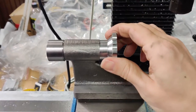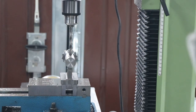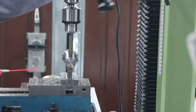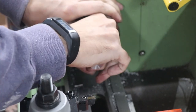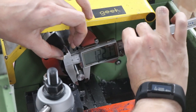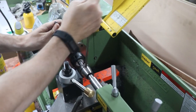Another satisfying moment to screw this on - ready to start cross drilling for the main fixed pillar of the clamp. Working my way up through drill sizes and then another newly purchased reamer. This is an imperial reamer because one of the components I got with the kit was a half-inch already-prepped bar stock, so I needed to get the reamer to match. I did try and do as much as possible in metric - all of the threads I made metric.